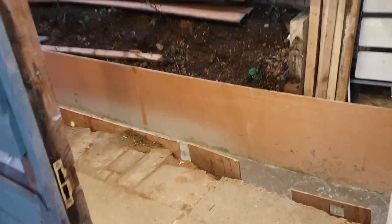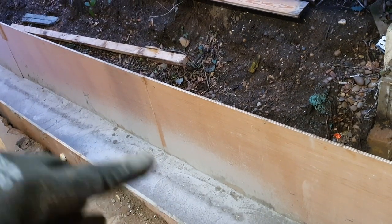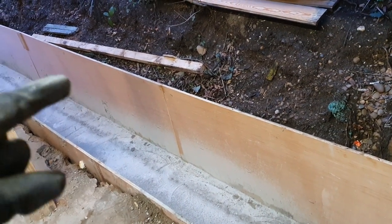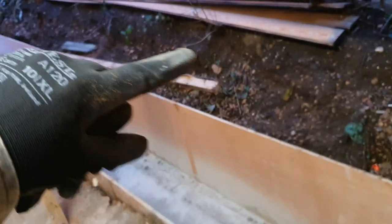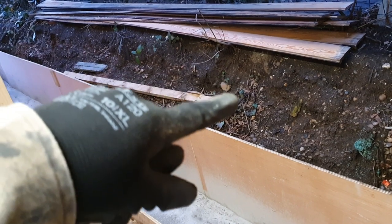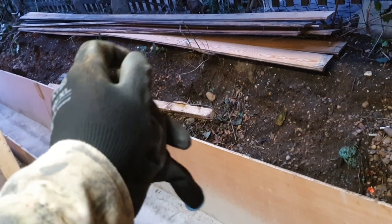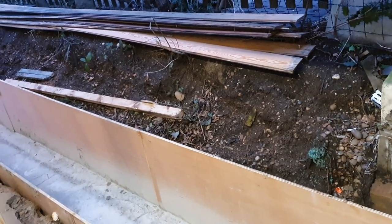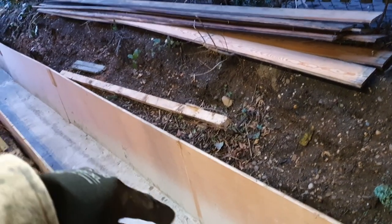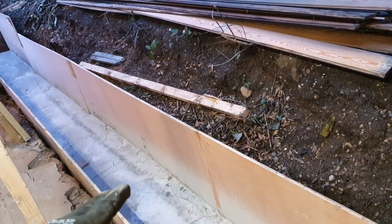This wall here, which is going to have to be a retaining wall, I'm going to build it internally and externally with concrete block, and then I think I'm going to paint on the bitumen water-repellent stuff because it's all going to be below ground. We're going to do it in blockwork, and then when we get to the top we'll do three courses of engineering brick to tidy it up. Double block on the outside up to the top, 150mm, come back in, three courses of engineering, and then we'll come out of the ground proper. Then we can backfill all this once it's got a double retaining wall in. Inside as well, we'll be filling the cavity to a certain height so that the internal and external leaf aren't under any pressure, and sloping that backfill to the front edge.